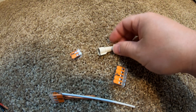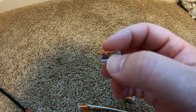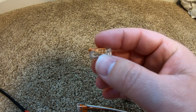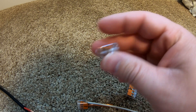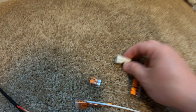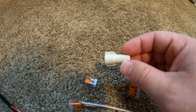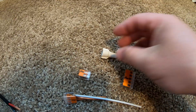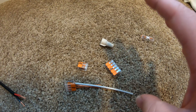Another thing that's awesome — this connector right here is rated for wire sizes 24 gauge all the way up to 12 gauge. You can use any size wire in that range with this one connector. Most wire nuts are only bridging about two gauge sizes, so you have to get different wire nuts for different sizes. This just helps simplify your collection of wire connectors substantially.